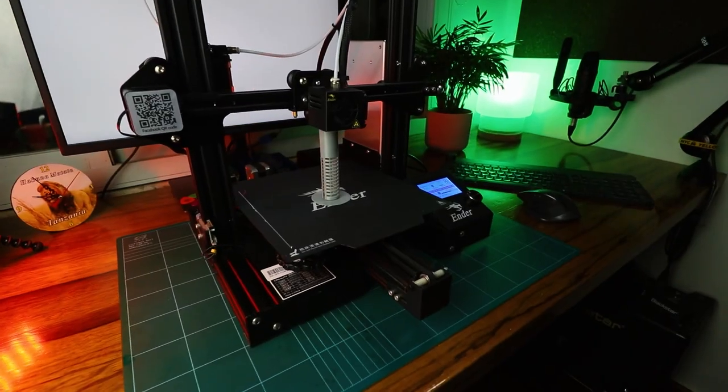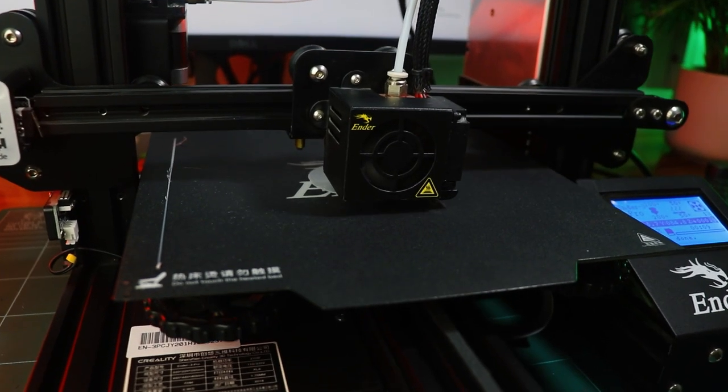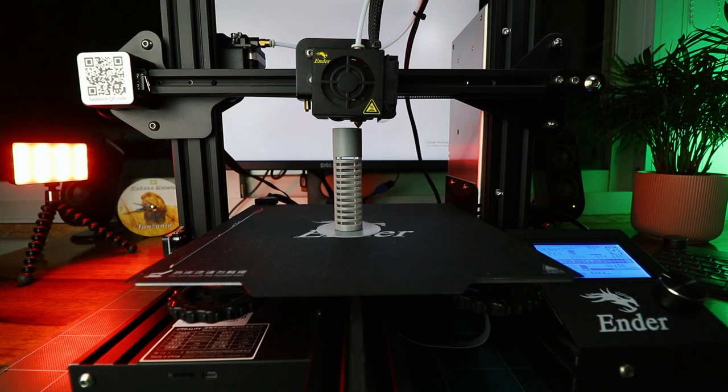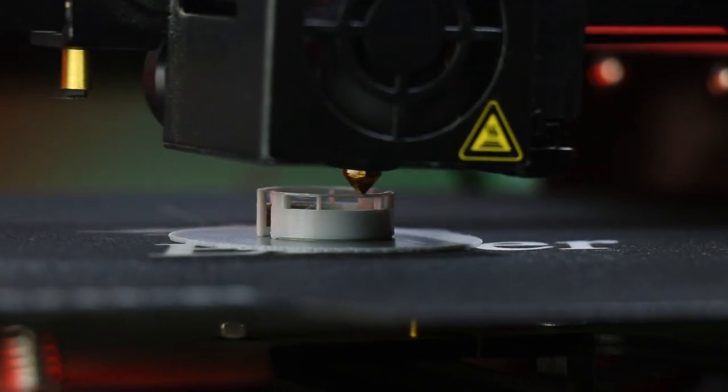Anyway, if you don't run into this problem, good for you, but it is something to be aware of when the project involves electronics and audio equipment. Printing the microphone body was a nightmare at first, until I figured I should print it on a raft, upside down, since it's so tall and narrow. This way the grills have less chance to get knocked over.